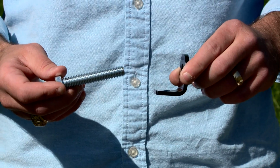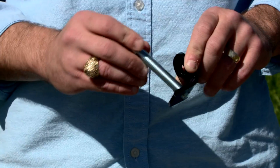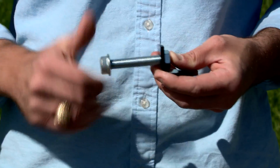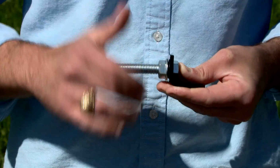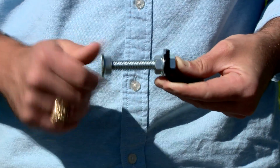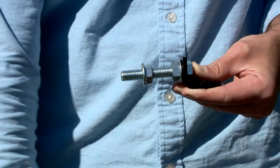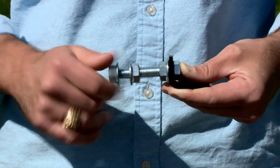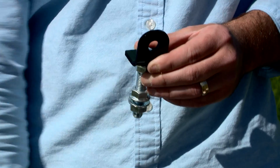First, assemble the adjustable height locking mechanism. Use the proper bolt for your unit. Put the bolt through the non-radiused side of the adjustable height lock bracket. Hand tighten a flange nut onto the end of this bolt. On the same bolt, hand tighten a second flange nut, this time making sure that the serrated side is facing away from the adjustable height lock bracket. Place a third flange nut onto this bolt as shown.